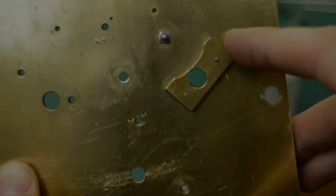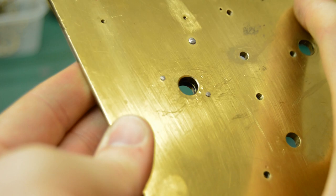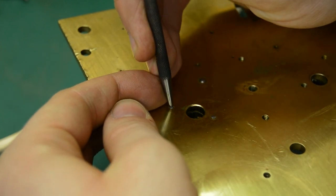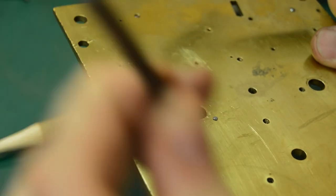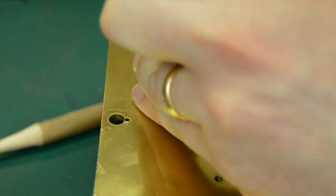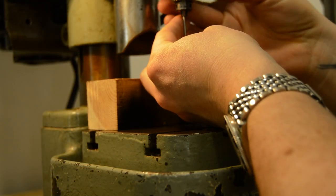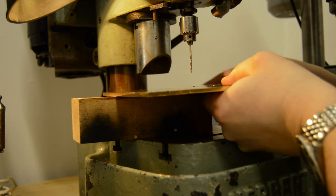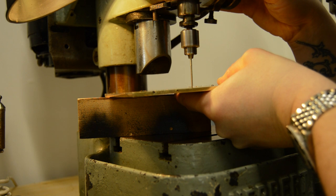Now moving on to this rather nasty repair. This was a previous way of dealing with the wear in the front bearing — the front bushing of the fusee on the going side. They've actually riveted a lump of brass on, drilled it and pinned it, which is not a particularly nice way of doing it. Rather than actually bushing it as we would, they've added this piece of brass onto the front to take up the wear. So firstly I needed to drill out the pins that had been riveted over — I just centre-pop them and then drill them out. I'm not drilling right the way through; I'm just destroying the peened-over area, and then I'll bash them through with a punch.